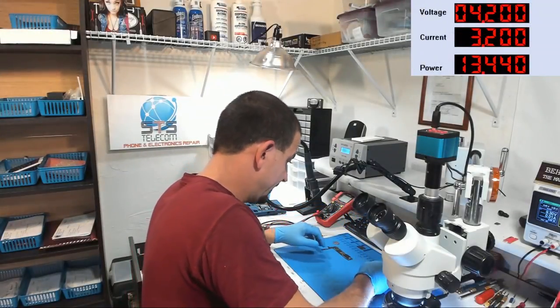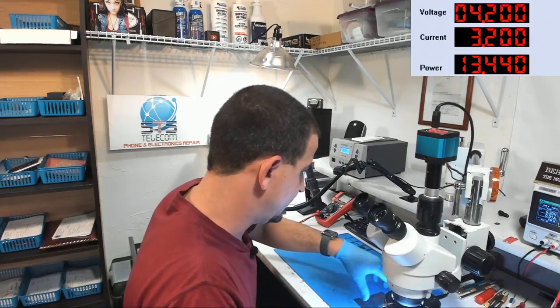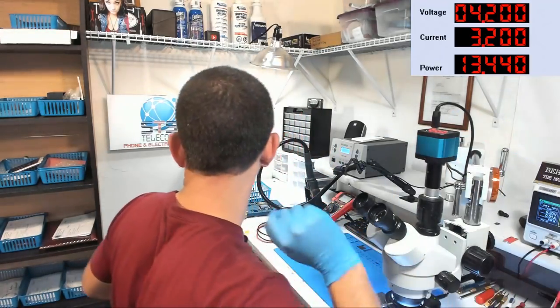I did it anyways. All right, so now we have a brand spanking new chestnut IC with beautiful non-hairy leaded balls. Now I'm gonna clean up my tools and my spot on the bench here so I don't lay my arm in that crap. There we go. Scrub with the stencil there.